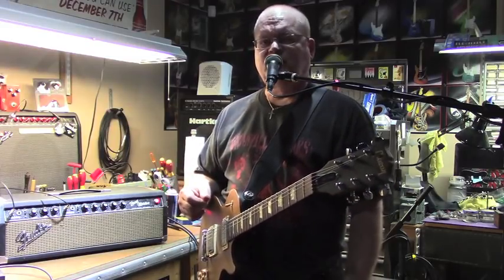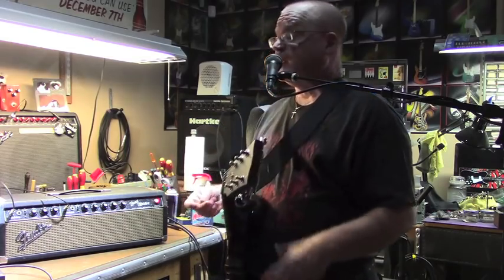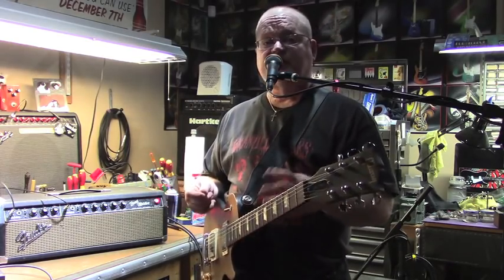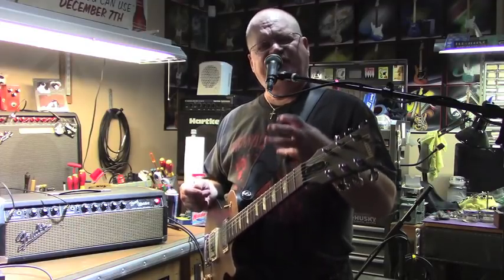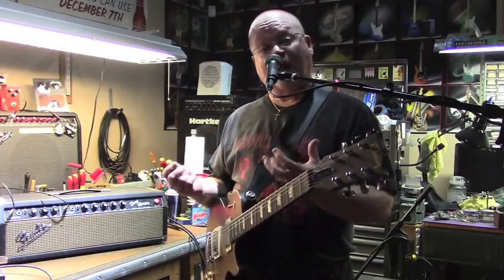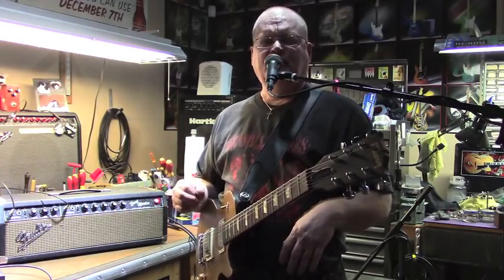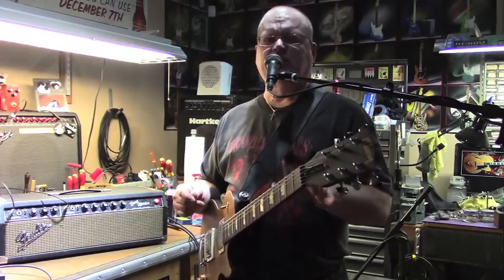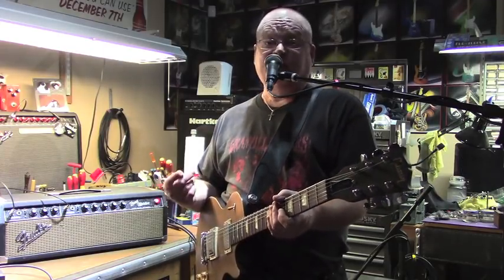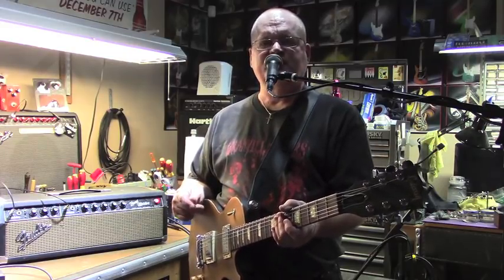So overall, I'm happy with the way it came out back then. I think I like it even a little better now because with the 6L6s, it was a little bit stiffer, and the solid state rectifier plug-in that it had. Now it's got the tube rectifier. It's a little spongier. It's a little more dynamic. But with the values that I chose for the phase inverter, it's still controllable, and I'm happy with it. And I think the current owner is going to be happy with the changes that we've made.